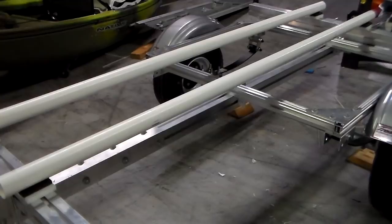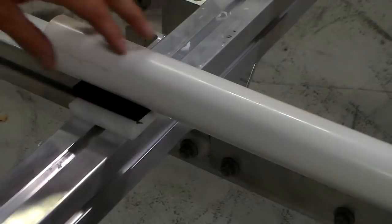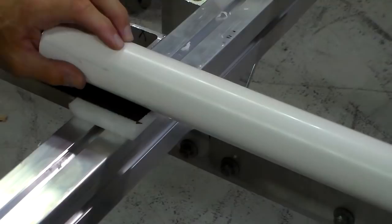Size the pipe and make the attachment support in such a way that the pipe can flex and conform to the hull — that's the whole idea behind this method. Your final attachment of pipe needs to offer enough play so that when the pipe flexes, it's not going to crack or break against a rigid mount.